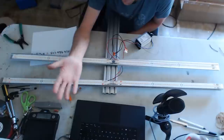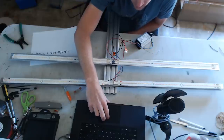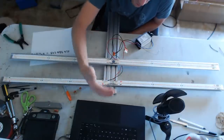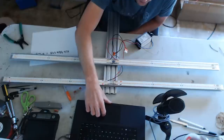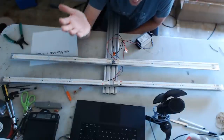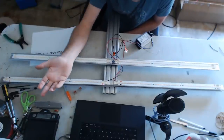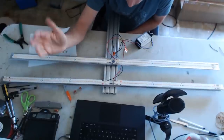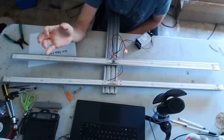Going through the comments: for a 5.3-amp driver, divide by however many strip sets you have. With a 5-amp driver, four strips would be too much — you'd really want to run six, maybe even eight strips, and run them really efficiently. Below 1 amp these strips are very efficient, and if you parallel up below 1 amp per strip you might reach the efficiency level where you don't need heatsinks at all.